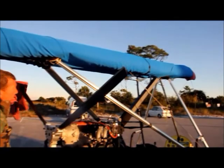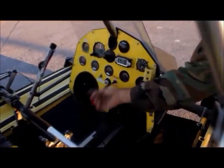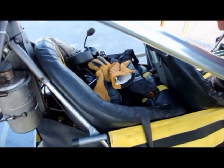Now I can take my front protectors off. Make sure all my power is off - dash, pull my key, secure it, key out and panel power off. I work the pod cover from this side always - always from the side without the landing gear control mechanism. Make sure my zipper is seated all the way, seek the zipper in, put it down. Not forgetting there's a strap under the keel. Secure all my gear - that is finished. Now taking everything out of the seats. I buckle my seat belts if I'm not going to take them out; if it's going to rain I take them out, if not I just seat belt them in.